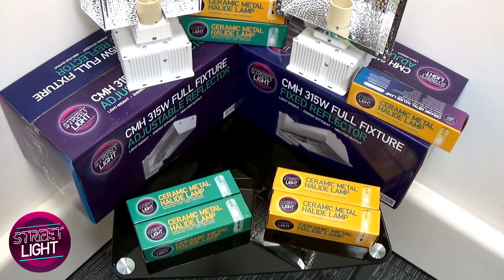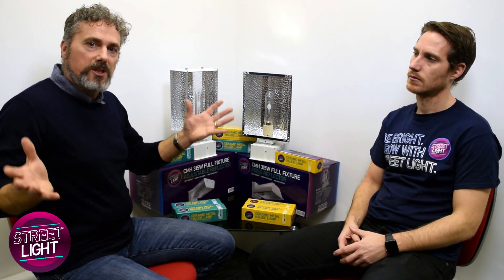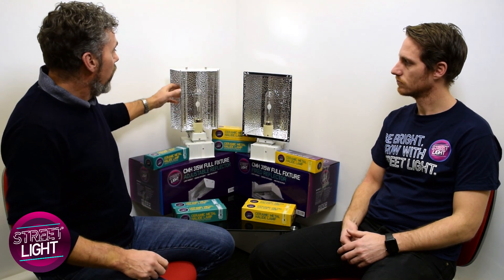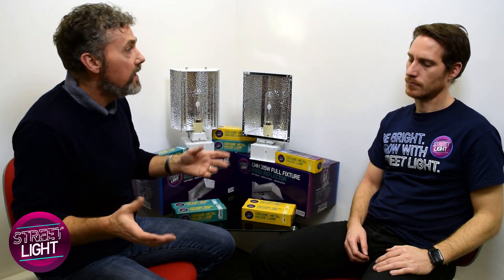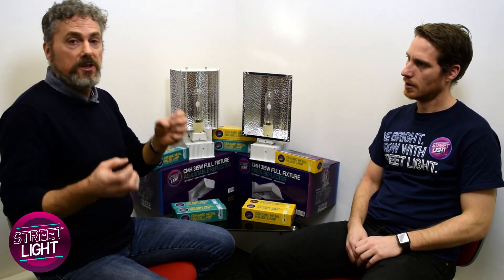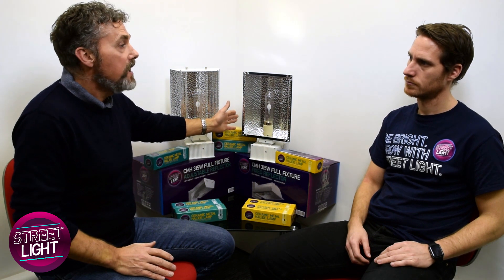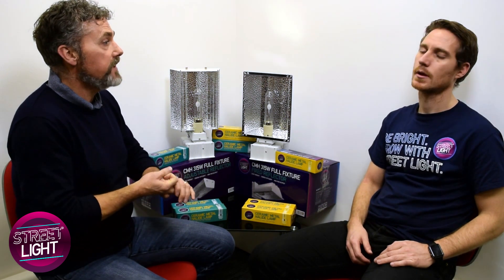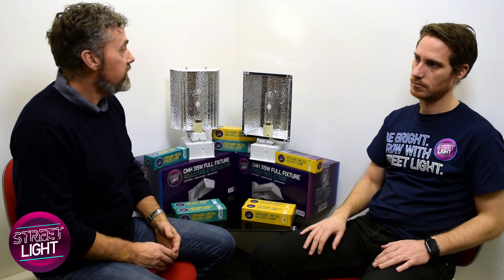In terms of the grower, who's it suitable for? Is it a larger scale or for hobbyists? The spectrum is quite wide of who can actually use this lamp. If you're a larger grower, you would probably want something like the adjustable lamp, which you can actually change the actual width of the beam. For a hobbyist, maybe using it in a tent, this is where we've got the benefit of the lower running temperature — something like the fixed reflector will be ideal because there's going to be less power needed to take the heat away from the tent. For the hobbyist, it is definitely an upgrade because it's going to save your power — 315W as opposed to 600W — and also the ventilation as well, trying to get the heat out of the tent.